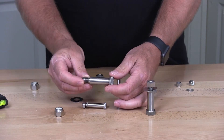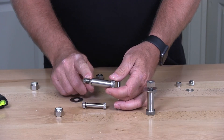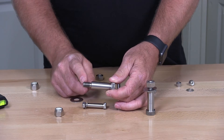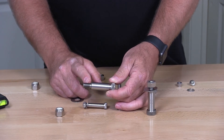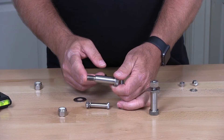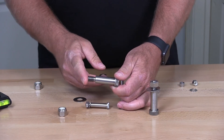The threaded section — whether you get this shoulder bolt in 2 inches, a half inch, or 5 inches long — the thread portion will always be the same length. On a 5/8 bolt, it's approximately 3/4 of an inch in length for the thread. When you have a 5/8 shoulder, your threaded portion is going to be 1/8 less than the 5/8. In this case, 1/2-13 — half inch being the thread diameter and 13 being the thread pitch.